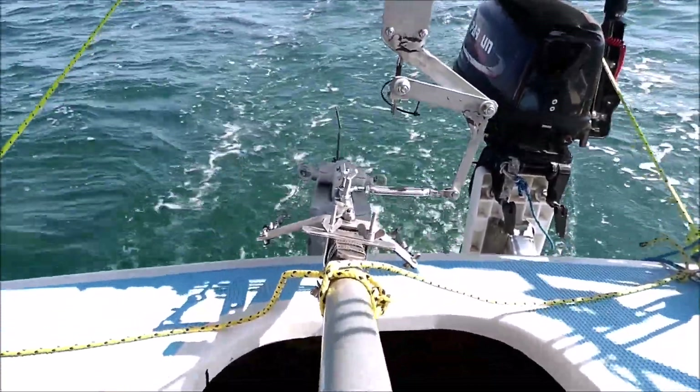My system consists of a balanced steering rudder or trim tab attached to the rear of the transom mounted rudder box. Cables on either side of the daggerboard rudder are attached to a control lever on the tiller handle to control the trim tab's movements. This in turn is operated by a bell crank and a push rod connected to the vane head above. A counterweight returns the vane to vertical when the wind is not acting upon it.